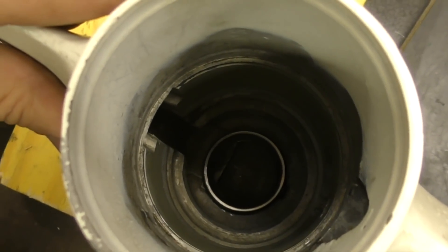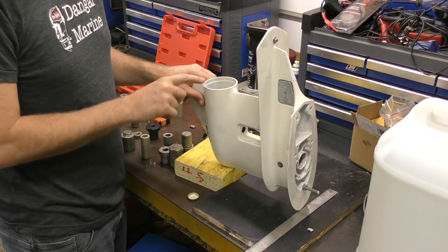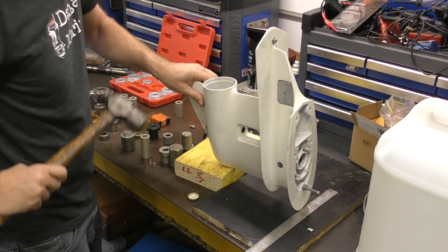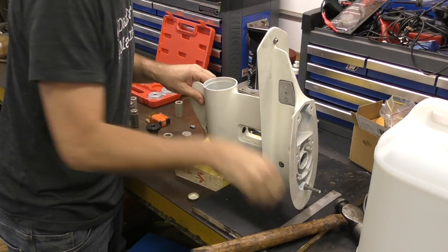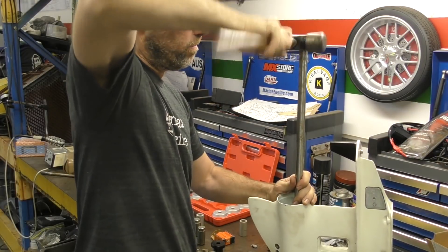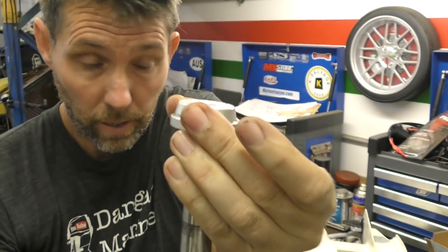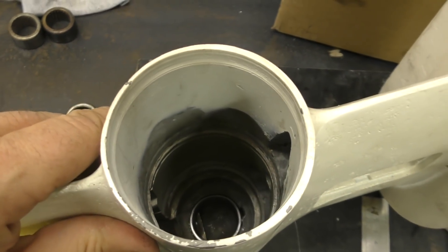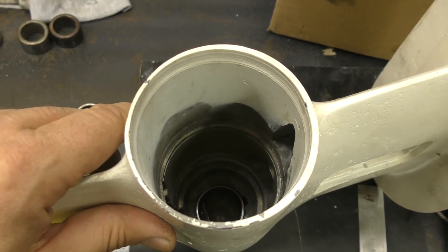There it is down there, just resting where it needs to go. I've got the gearbox sitting on a block of wood so as I hammer it down, it won't damage it too much. The handle on this tool is not long enough to reach out of the gearbox, so I'm actually just going to give it a few taps with the handle of the hammer, just to get it started so it stays in position first. That got it started so it's not falling out. Now I'm just going to find an extension rod to put on the end of the tool and drive it all the way home. I realised that because this drive shaft is slightly tapered, you can sit it on the tool and it sits quite nicely, so it worked alright in the end. Now we've got our bearing race down in there — it's seated flush and it's all the way in. You can hear it change tone slightly when it's all the way down, and the edge is even all the way round. A tool like this is pretty important because it's very hard to get onto that with anything else, and if you damage the inside surface — if you're tapping the edge and you scrape down it by mistake — that little nick will wear the bearing very fast. I think this whole set cost about $40, so not that expensive.